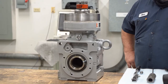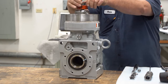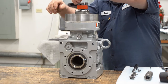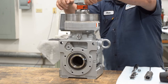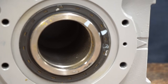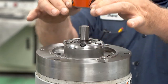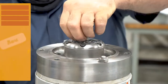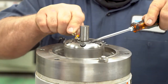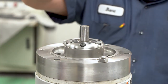The first step is to remove the motor and the motor adapter to expose the backstop. Bart is going to rotate the shaft, and as you can see, you can only go one direction. In our case, it is rotating counterclockwise. He's removed half of the shaft coupling, then removed the key from the shaft. Use the retaining ring plier to open up the retaining ring, then use a screwdriver or small pry bar to help you lift it up and separate it from the shaft.